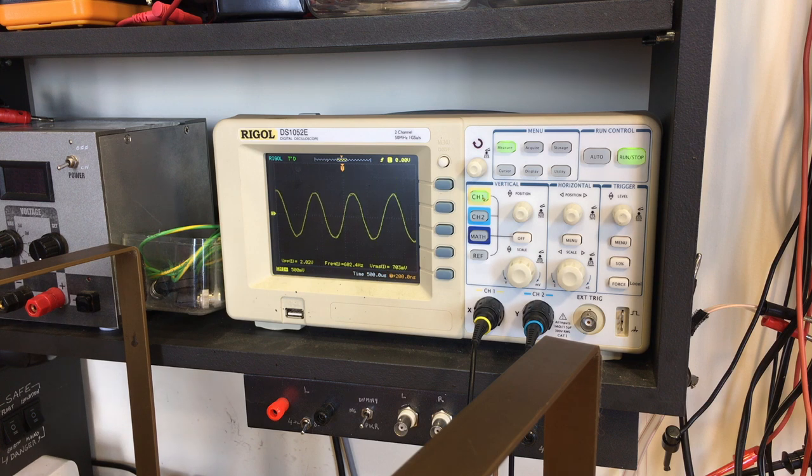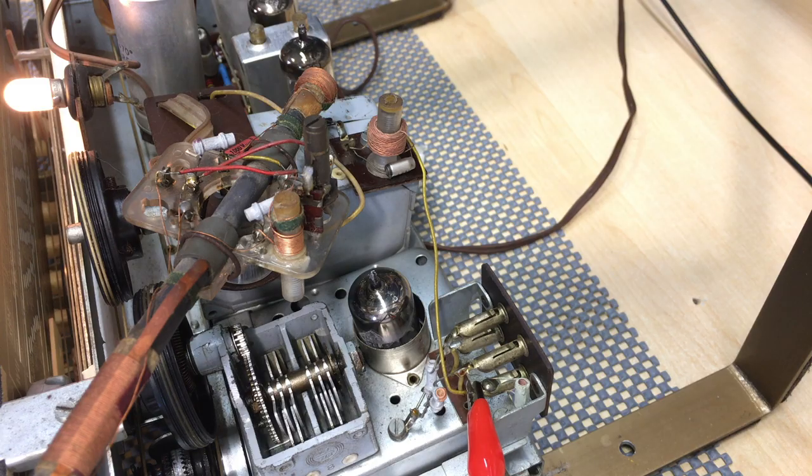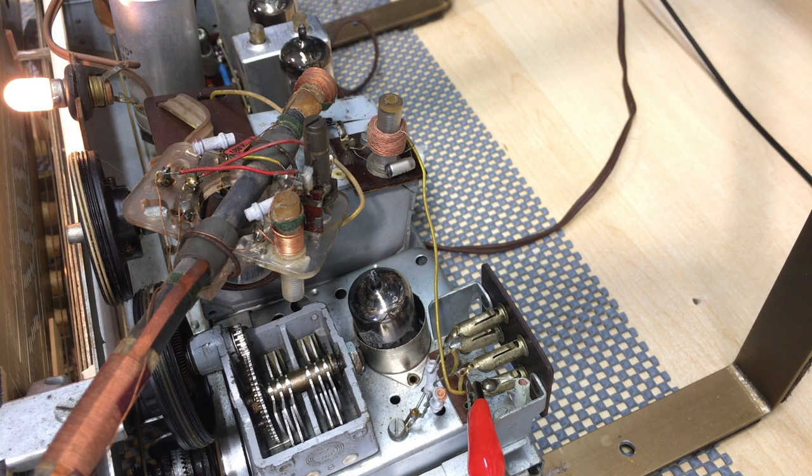So there we go. Decrease the volume, increase the volume. This is our signal. And we've basically tuned the IF of the AM. And now for the final test, we'll adjust the IF trap. It's that coil over there, coil 10. Now this thing's got a big blob